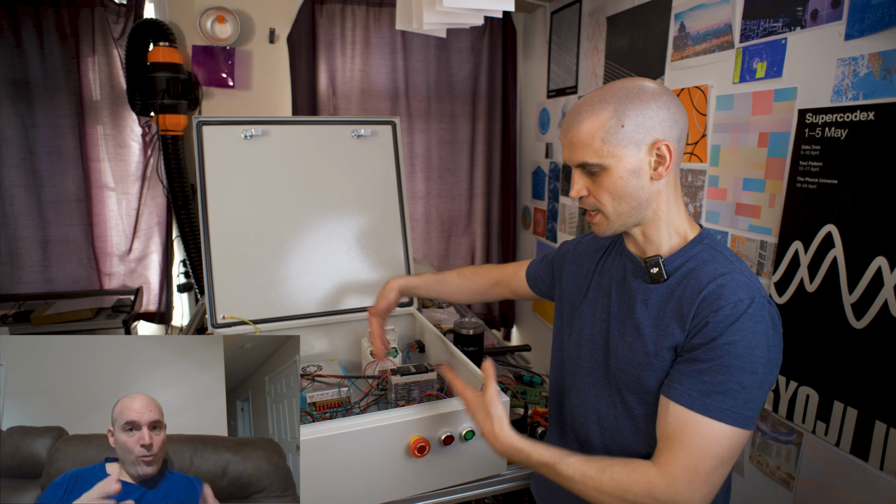The CNC controller is only one component that makes up a synergistic robot. Keep in mind that while that controller may show signs of stability when the robot is not running, when the robot is running, that's a different story, because that's what really matters. When you run an 8, 10-hour, 12-hour job, that's when you're going to find out if the robot is stable. These guys that run or show you jogging back and forth for 5 minutes, that's typically not what you're going to find as far as finding instability unless something is majorly wrong.